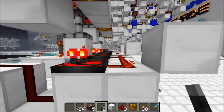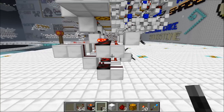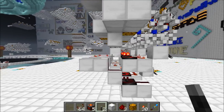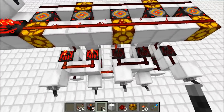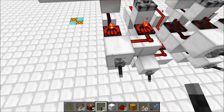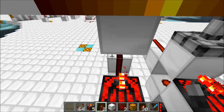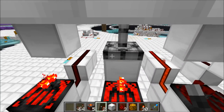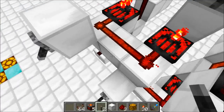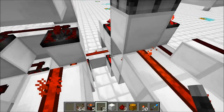What we've got here is a bunch of multiplexers. I did a tutorial on multiplexers — if you haven't seen it, it's worth checking out because they're super useful. In short, a multiplexer is a device that takes multiple inputs and selects one of them as the output. What I've got here is a bunch of multiplexers set up, and the inputs to the multiplexer can come from one of two places. This input over here can either go straight through to this multiplexer or it can shift one to the right and go through this multiplexer.